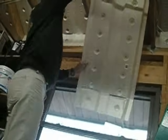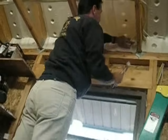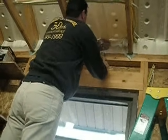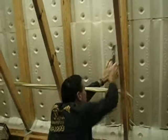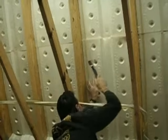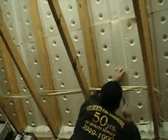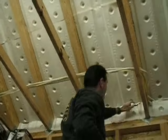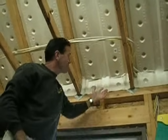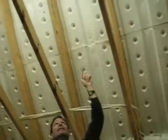I'm going to show you how this went. It's a kind of flimsy material, but it works out just fine. Pack it up and try to keep it tight to the side of the rafter as possible. So what's going to happen is, we put our insulation in here, the airflow can come in, run up these channels, right up to the ridge vent. As you can see, we've got the baffles run all the way up to the top of the ceiling.